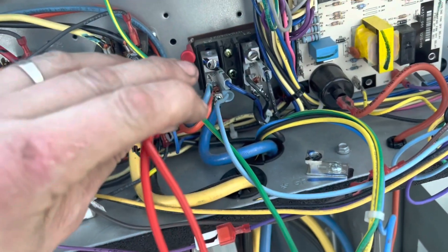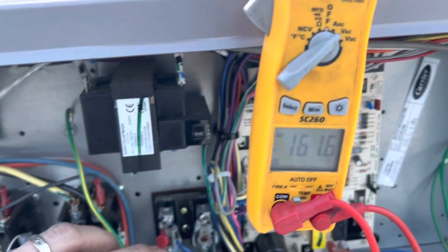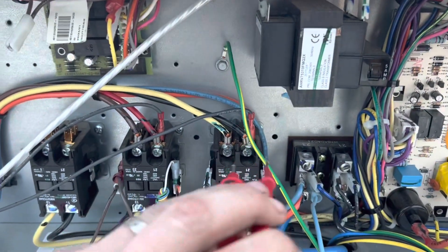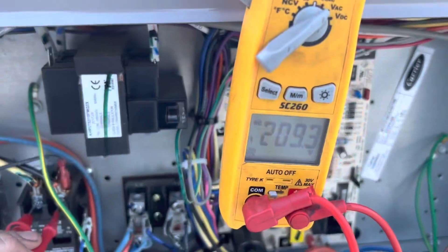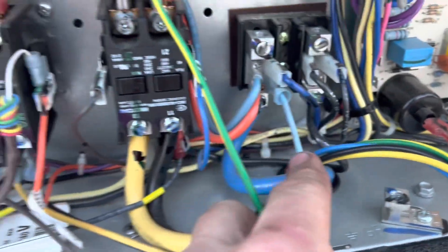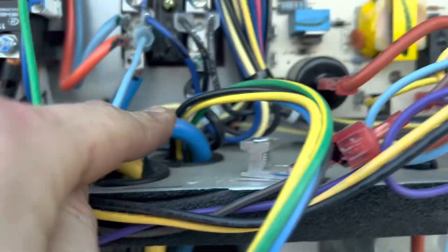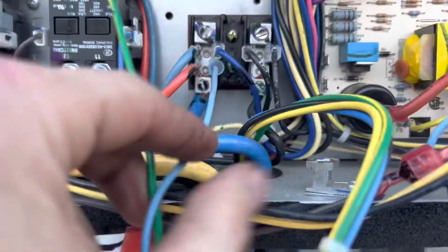Let's confirm voltage across all those — 208, 208, 208. That's correct, so those are the three we use. This one's already taken — fully occupied, no extra spades here. I can't use that one because it's the black leg and you'd be single-phasing your motor. I need to see what all these are — I think this blue is actually the power running to the motor master, so we may adios that and see how she runs.